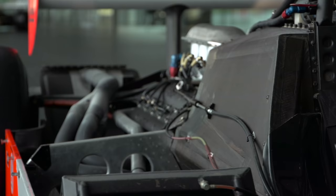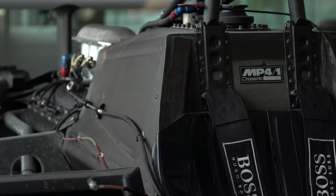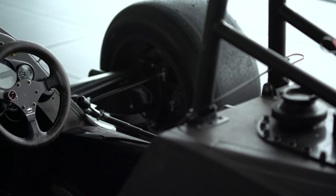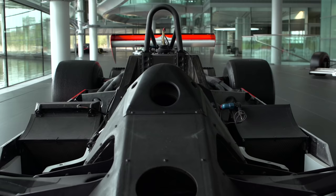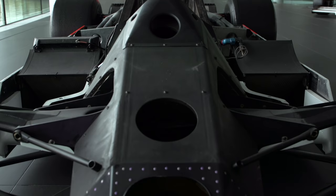The only joints would be when we fitted the seat back panel, and then there were two extra stiffening panels inside the monocoque that glued and bolted inside, together with a single front bulkhead that mounted the suspension. The monocoque had I think five pieces in total, which compared with the standard aluminium monocoque at the time would have been hundreds of pieces.